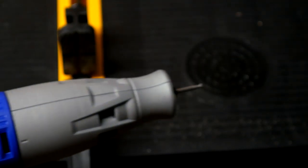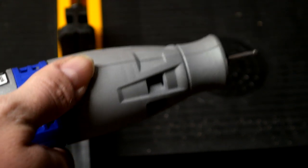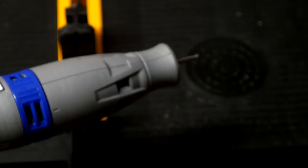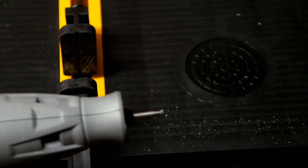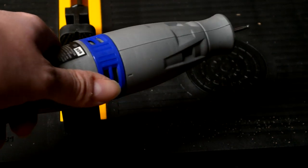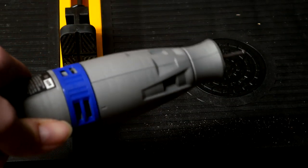Speaking of which, I don't know if you noticed there, but when you're actually done using it and you've got this big hose over your shoulder or under your arm and you're trying to reach up onto the tool to spin that ring, it's unwieldy to use. You don't have a nice on-off to just stop the blade from spinning. You have to reach up onto the tool and find that ring. It almost feels a little dangerous to me that you're trying to get a handhold to turn this thing, and you get pretty close to the blade. So, I would say that ergonomics on it are pretty bad too. Besides the hose, the way you turn it on and off is kind of crappy and weird.